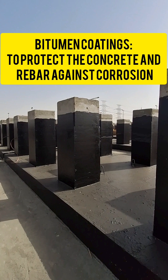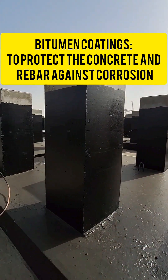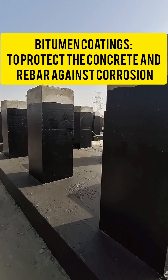This bitumen paint should also be some extra microns thick, otherwise it serves no purpose. Protection against dampness is also important — while standing water can aid curing and hardening of concrete, it is the salts and minerals in that water which cause harm to the interior rebar.